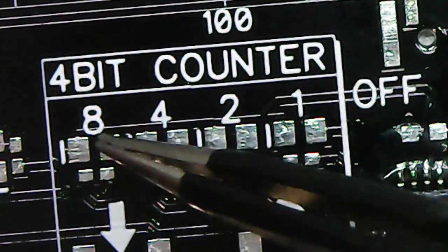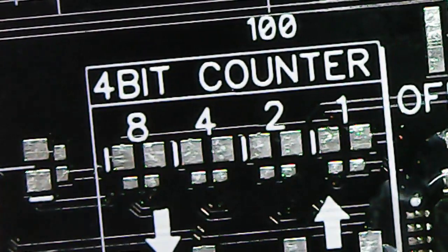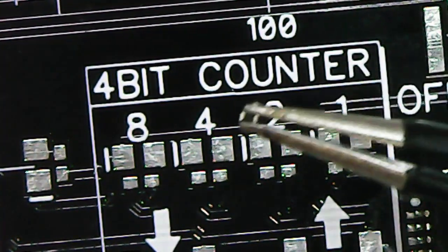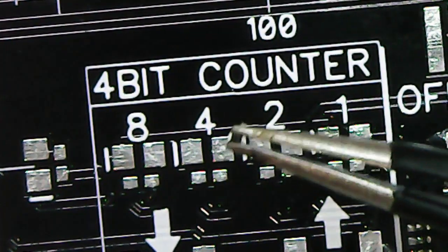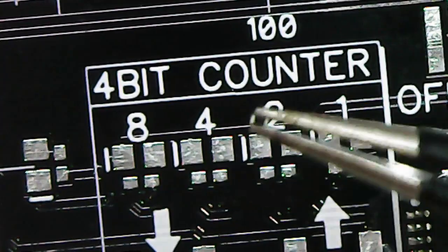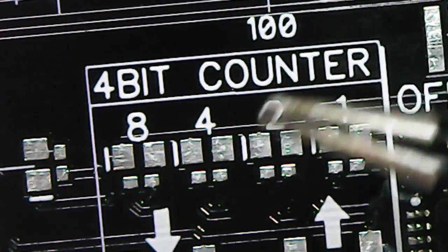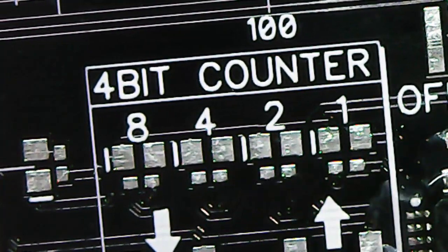Put solder on one pad, pick up the capacitor, reheat the pad to reflow, rotate the board, and solder the other pad. Now for the battery holder. The little white dot on the holder lines up with the white dot on the board for the retaining metal clip. Rotate the board, add flux, put solder on that pad. I'm not giving it enough time to heat the pad for the solder to flow properly, so let me use a fresh battery holder.